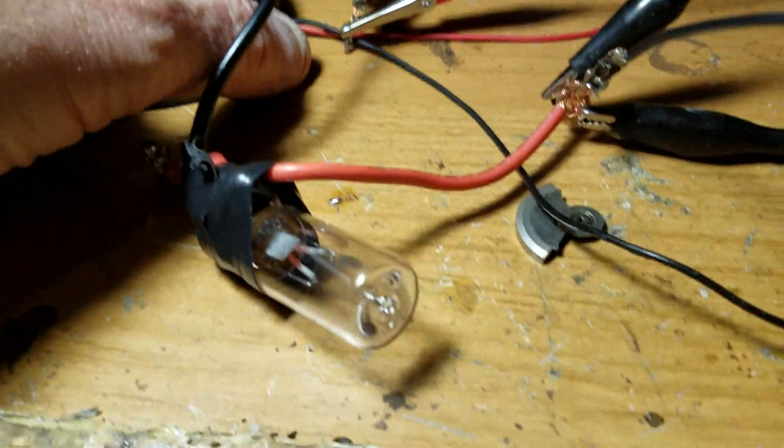I've got a resistor across it for current limiting. Let me turn the resistance just a little bit to shunt across it — there it goes, I've got it to fire! It fires at 9.9 volts and 0.32 of an amp. Wow, the gas is just amazing — the light this thing is producing from the gas, I just don't know how it does that.